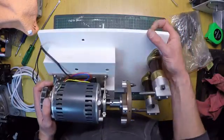I mounted the motor on two pieces of 50 millimeter high aluminum profile just to get the right height, and it actually lines up pretty well with the electrodes. Another thing that was quite hard to come by was this transformer here — that's a step-down transformer, because Australia is 240 volts and this motor is 110–115 volts US. These transformers are very expensive, but I managed to pick up two for twenty dollars.